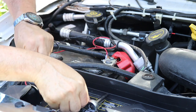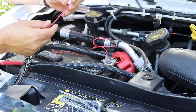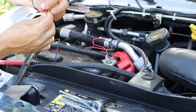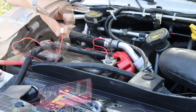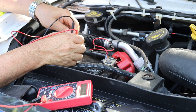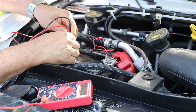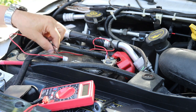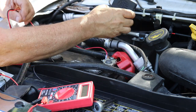What I'm gonna do is test to make sure I'm getting positive and negative and there's no problem with the wire before I connect it all up. This way, if the unit's not working, I know it's not a wiring problem. I have my voltmeter — I get 12.75 volts, so my wiring is good. I'll wrap this up and we'll attach it and plug it in.